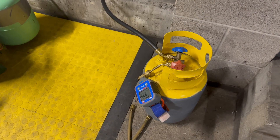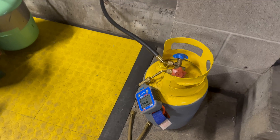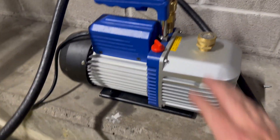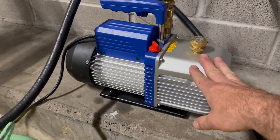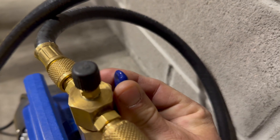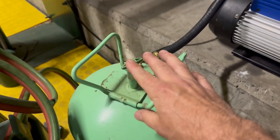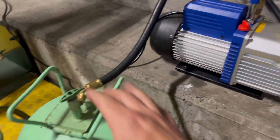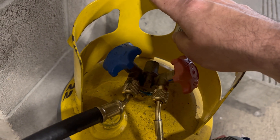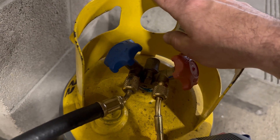I've got a recovery tank under evacuation. I've got my vacuum hoses hooked up to the vacuum pump. I can isolate this vacuum pump right here and break the vacuum with refrigerant, which will then go into the recovery tank because we will be recovering refrigerant and reusing it.